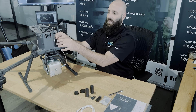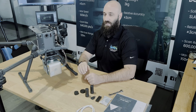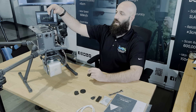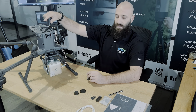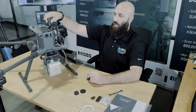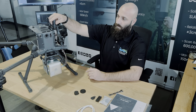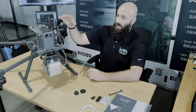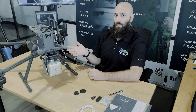From there, we'll use the added clips that are provided to put the GNSS cables inside to keep them from bouncing around and moving during flight. Then we will go ahead and connect our GNSS antenna to the top. On this, it doesn't matter — it's either or, they're both suitable. And from there, you have your officially set up X3H mounted to the M300 drone.